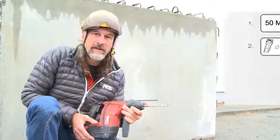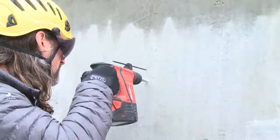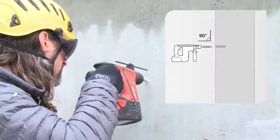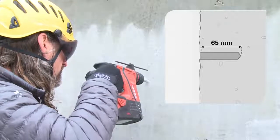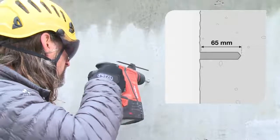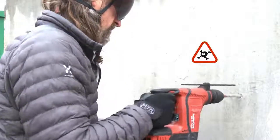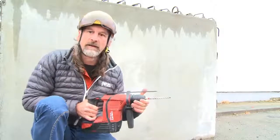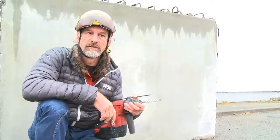So when we're drilling our hole for placing the COEUR PULSE, a couple of things to be aware of. Firstly, we want to drill a nicely aligned hole, 90 degrees from our parent material. Make sure that the hanger plate of the COEUR PULSE sits flat against the rock, avoiding any other issues later in the installation. Whilst drilling, something which you'll see later, but we need to be careful that we're not moving or tilting the drill during the installation, because this, again, it's going to make a hole that's too big, and a hole that's too big doesn't give us sufficient pull-out resistance.